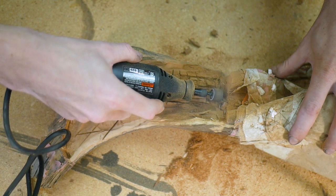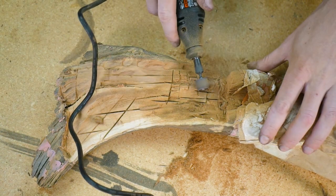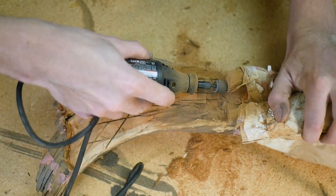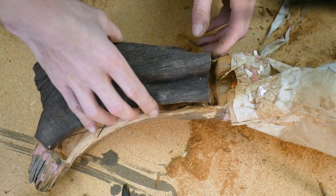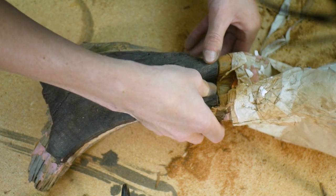It's not shown here, but I went ahead and trimmed the wax pattern along the embedded score line. At this point they should be a pretty close match, but wax does warp and I didn't cut a perfect line in the wood, but I still have a lot of room and time left to make small adjustments to try to line them up as nicely as possible.